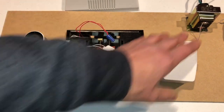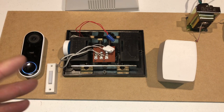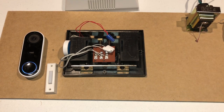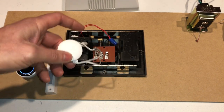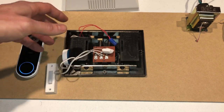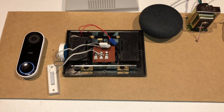This one is rated at 24 volts too. You can get it in 18 volts, so it'd probably push out about 21 volts and you would be close to the requirements of the Nest Hello. But I still recommend — and you've spent a lot of money on your Nest Hello — the best thing in my opinion is to bypass the chime and hook it directly up to the doorbell. You don't need the power kit anymore because it's just a capacitor that stores electricity to use when the chime is drawing so much power.